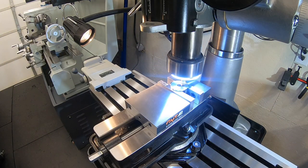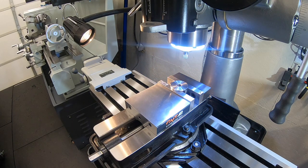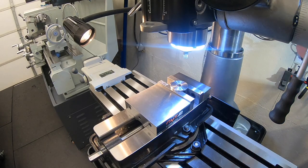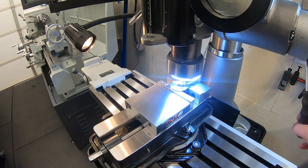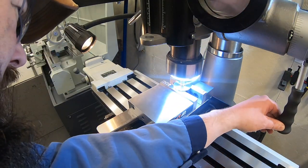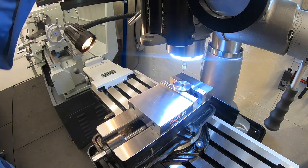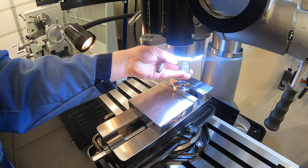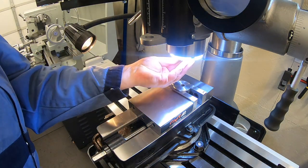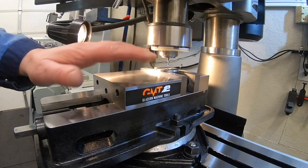All right, I still have another inch to go from there. It's gonna be cutting it pretty close. Let's drop this head a little bit. I don't wanna be cutting it that close, no reason to. All right, that is lined up close enough for what we are doing. So let me zero the DRO there. Ooh, just enough room to get it up. So we've got our piece centered up in here.